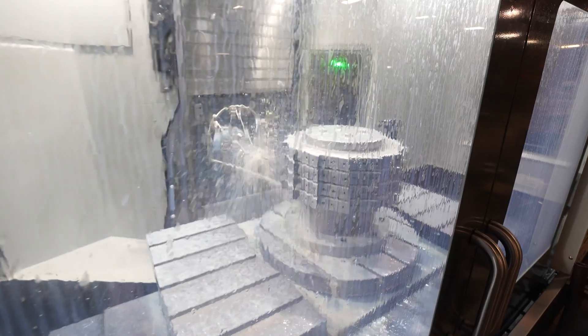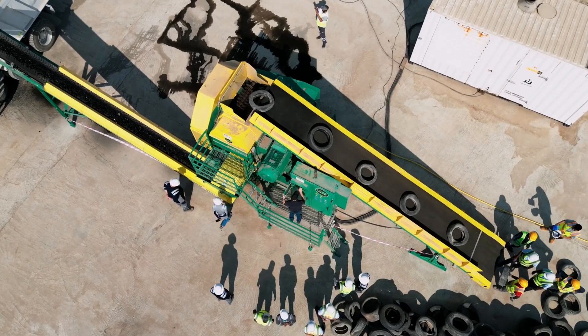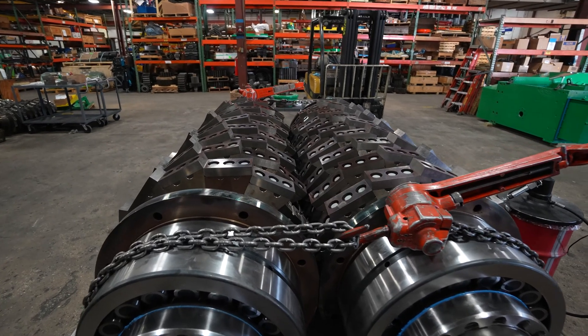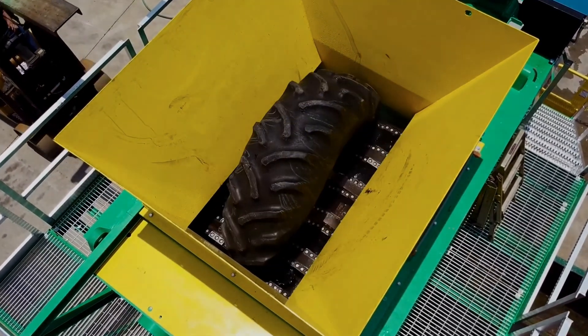At CM Shredders, one of our big niches is scrap tires and we have machines that are specifically designed to shred this very specialized waste. We have a very special unique knife system that's only used for scrap tires, where we use very hardened knife materials and also extremely close tolerances to cut all the individual little wires that are in a tire.